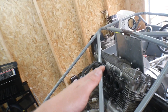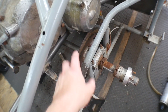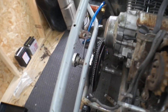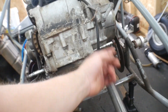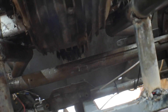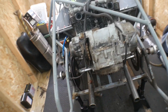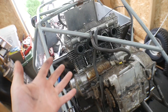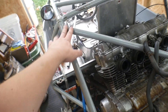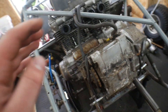If I need to cut this bar I will — I'll just slide it down and it will still be a good support. I'm going to cut it right on the edge and then the engine will shift forward and sit perfectly. Width-wise it is perfect. I didn't move the rotor yet but there is a ton of room to move it along with the caliper, so no issues there. Over here the sprocket completely clears that. The engine is not touching the axle; the engine probably will be raised a smidge but I can raise it up a couple centimeters just to ensure nothing bad will happen.